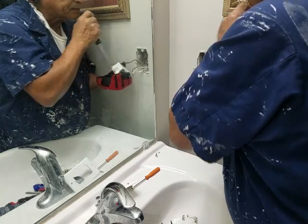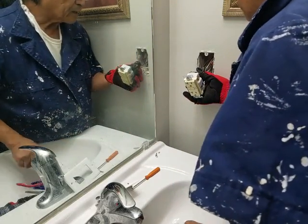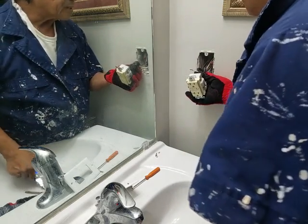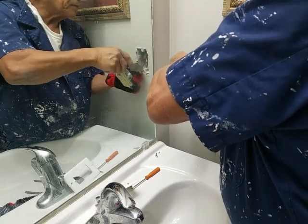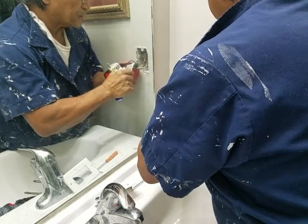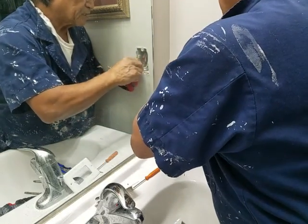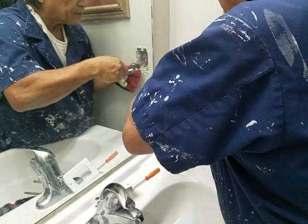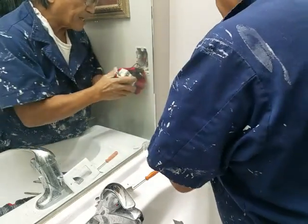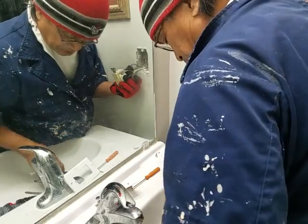There you go. You have about four or five wires here. Make sure they are all the way in and tight. That's all — how easy is that! A lot of people mess up though. Same with me the first time — I didn't pay attention and just kept connecting white to white and black to black. But these are not ordinary outlets. They have a special sensor that senses water. That's why once it trips, you can never push it back unless you remove the wet appliance first.